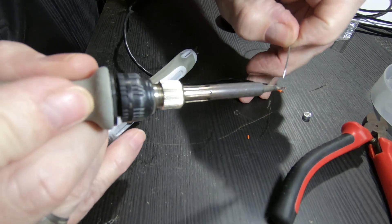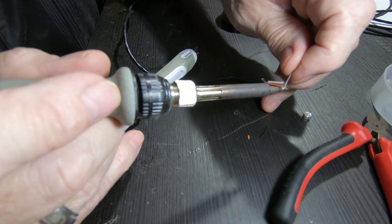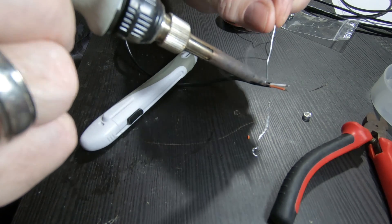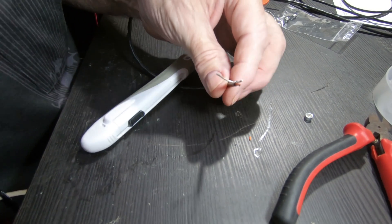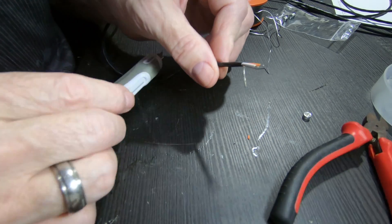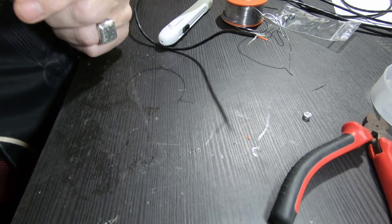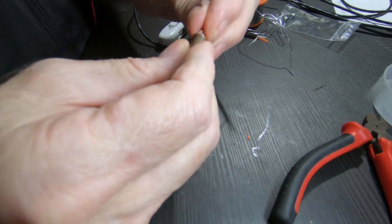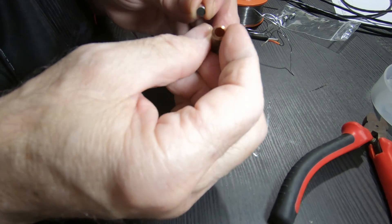Yeah, get a good wire stripper — it helps. I'm going to tin these guys, get them tinned. This one I'm not worried about — I'm just going to tin it on the end so it's not fraying everywhere when I try to push it through. Just put a little tin on there, hold them together. That's not bad — a little bit of solder with flux on there, it's ready to go. Now, what is nice if you can — for instance, for example — I'm going to take one of these and put this microphone in backwards if I can. I wonder if it's reamed out good enough. It's not. If you have a spare tube, this is a good way to do it, to hold that microphone without damaging it.